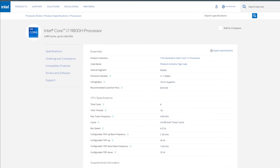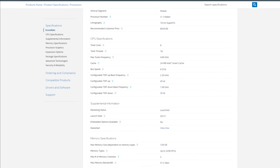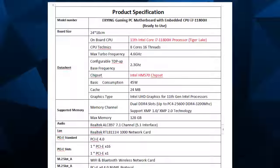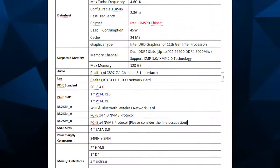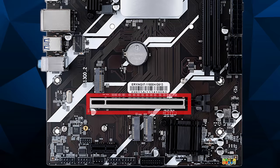First up, the processor: it's a Core i7-11800H. Out of the box, it's pretty locked down in terms of power delivery. It's based around the HM570-Z590 chipset, dual DDR4 support for 2133–3200. It has a built-in gigabit Ethernet card, one PCIe x16, one PCIe x1, one PCIe 4.0 x4 NVMe slot, one combo PCIe x4 and SATA AHCI, an E-key Wi-Fi slot for Bluetooth, and four SATA 3.0 ports.